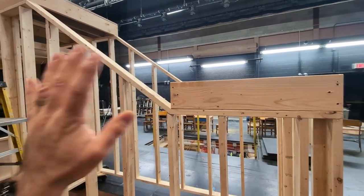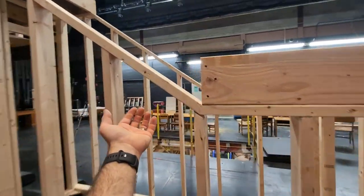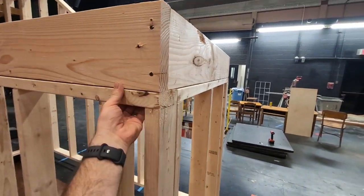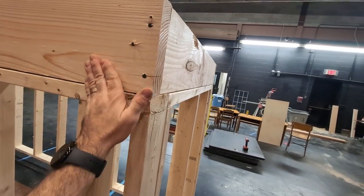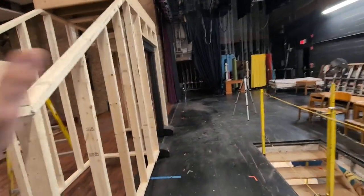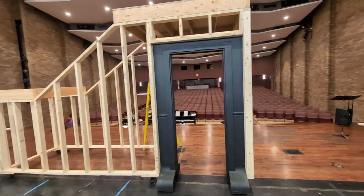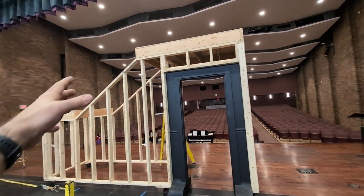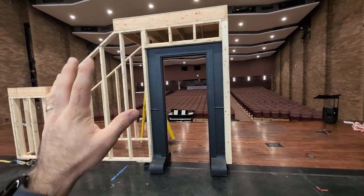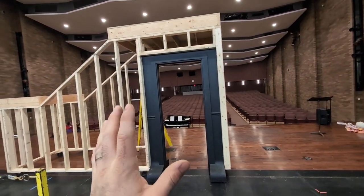However, I want to square this up with sheets before I go fortifying it and committing to those things. I've already committed to these rigid vertical members attached to these horizontal members, but that was a factor of them being the right size and being flush, so you can get away with that to a certain extent. But then you start wanting to lock this thing up and stop it from racking with a skin before you go putting all of the heavy-duty structural stuff in and committing to it, because later you come back to skin it and you want to move it around to accommodate the square pieces so that you're sure you're squaring it out, and all of the construction and rigidity that you added before it was square is fighting you, okay?